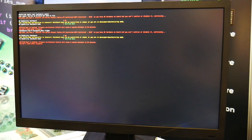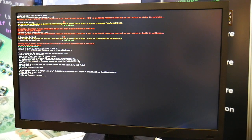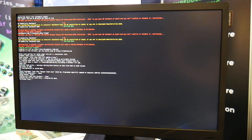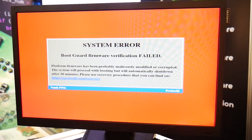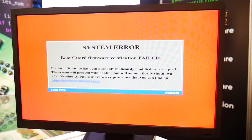So what I will do right now is trigger FlashROM, which is a tool to flash the BIOS on CoreBoot platforms. We can see that FlashROM is flashing a BIOS — and this is a malicious BIOS which is not signed by Protectly. Because right now, after enabling Boot Guard, all BIOS images have to be signed by Protectly.